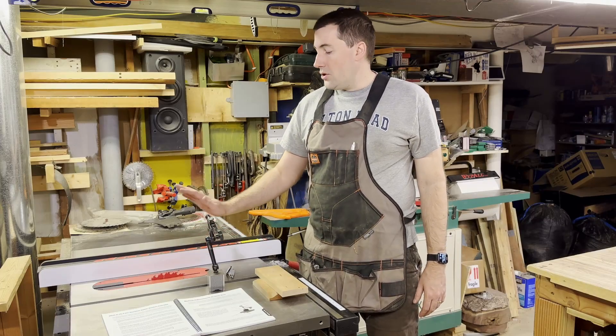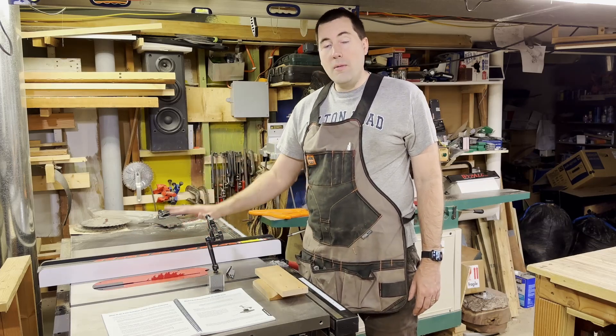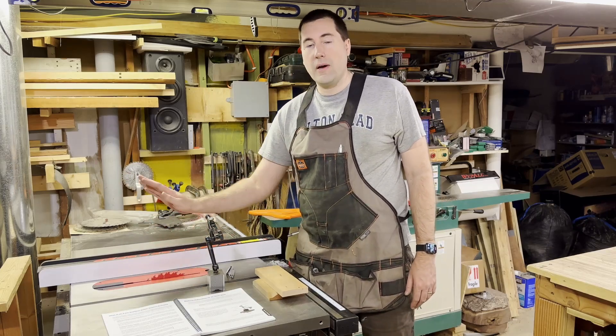Hello, my name is Jim. I'm going to be adjusting my saw stop today. It's not cutting real well — it's leaving kind of a jagged edge as it cuts. Not super bad, but I'm going to make some adjustments to make the blade parallel to the miter slot, and then also adjust the fence so that it's parallel to the miter slot.